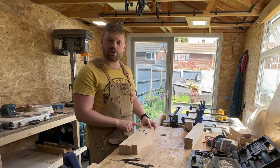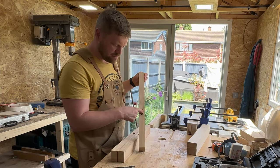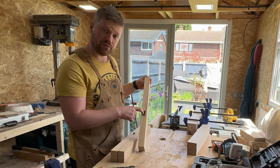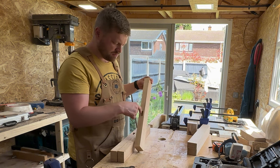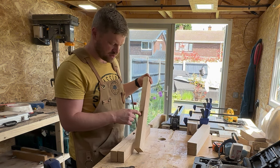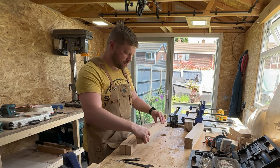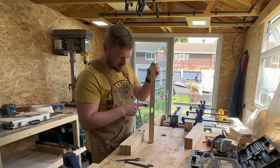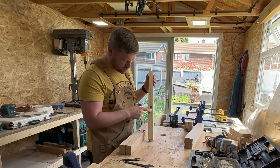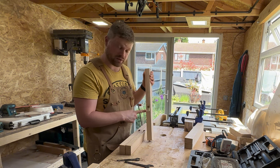So I've profiled all of these. As you can see, I've bored out the middle. I then used a router to basically flush trim all the way through, nice and square to the wood. It's left a really neat finish. So all I need to do now is cut out the rounded corners left by the router. I'll tidy these mortises up with a chisel.